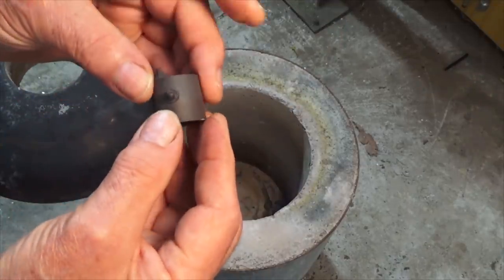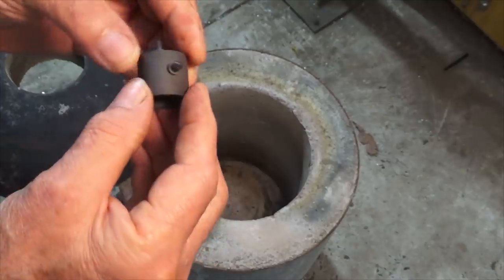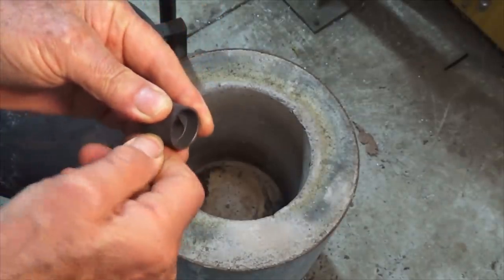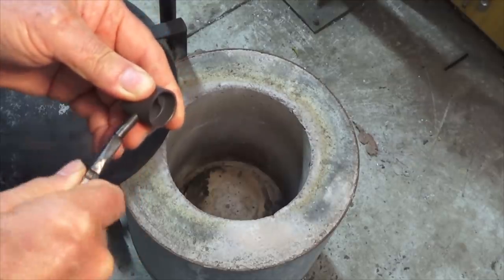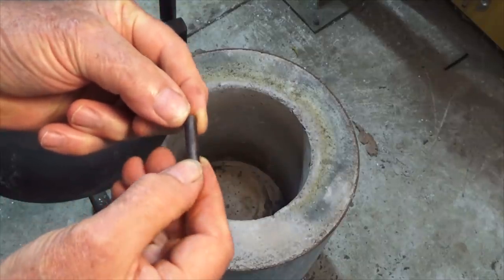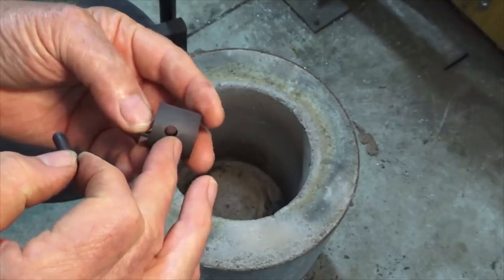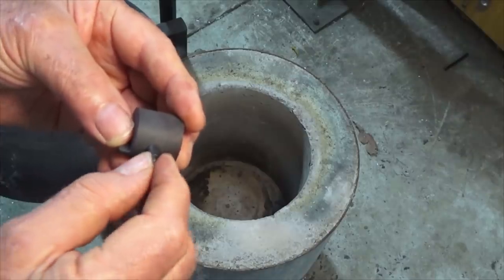All right. Well, there's certainly no flaking oxide on the surface of that metal. It's got a dull charcoal grey colour all over. But the surface on it looks really good, actually. Let's see if that pin will come out. Right. Even that pin doesn't show any signs of blistering. It's still relatively clean. So I'm happy with that. So it could be that the interior of that furnace was a sort of reducing atmosphere, not a lot of oxygen, so it's protected the metal from getting that flaky oxide coating on it.